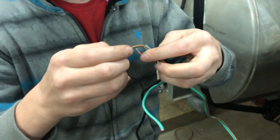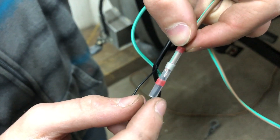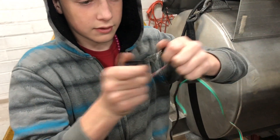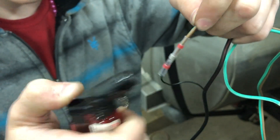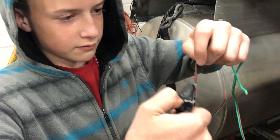Okay, that should be good — slips right over it. Now see your little metal in there, your little connection. You're going to want to put that solder right over that so that the solder gets right onto the wires. And you're going to grab your lighter. Try to do the ends first. You don't want to concentrate it on one spot because then it'll start to melt and won't get a good connection and it won't be waterproof.